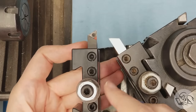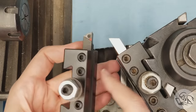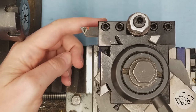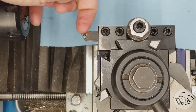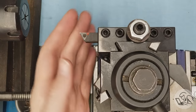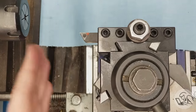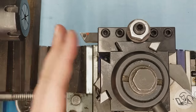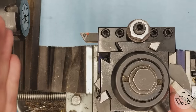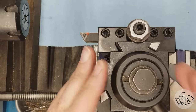For heavy facing cuts, you want either a dedicated facing tool — which looks like a grooving tool designed to be pushed into the work with a square tool post — or an easier trick: simply use a left-hand turning tool on the back of the tool post. Just like magic, that's now a facing tool. The cutting edge is presented square to the work and fed in the direction it's designed to cut, so all the clearances and cutting edge geometry are correct. The added advantage is that it lets you leave your tool post square throughout face, turn, and shoulder operations in quick succession, saving a non-trivial amount of time.